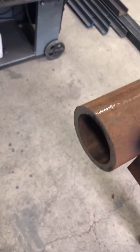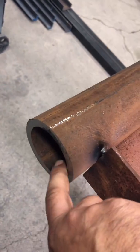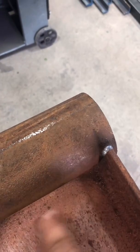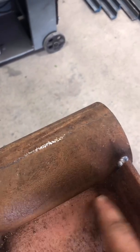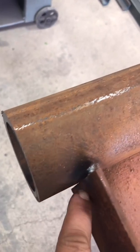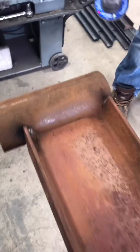I've got the seamless tubing squared up on the actual beam. We're going to run a pass here. I'm just getting the grinder ready with the buffing wheel to take all the primer off, making sure it's nice and clean so I get a good clean weld. We're going to be welding it all the way around. I didn't notch this part out because notching might throw it off square.